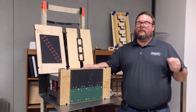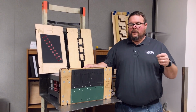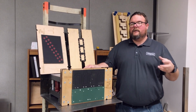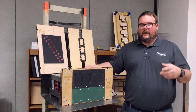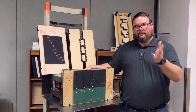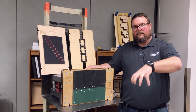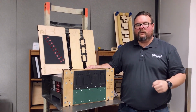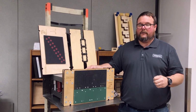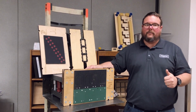It is important to point out, though, that with a feed-through punch, generally the material needs to be greater than 7/1000ths thick, and that has to do with the way the bevel is on the feed-through punch. That bevel, the material has to get past that bevel for it to actually pull it up out of the waste matrix. But they're very effective tools and can cut down on a massive amount of labor in a lot of instances.